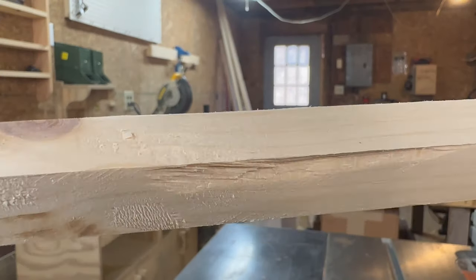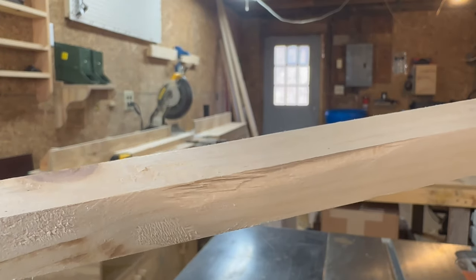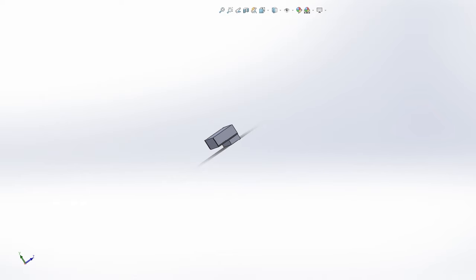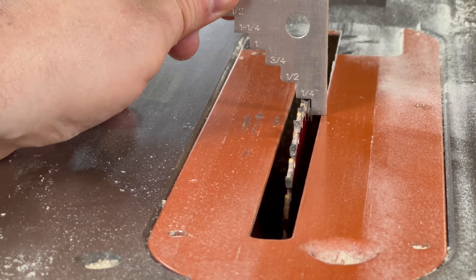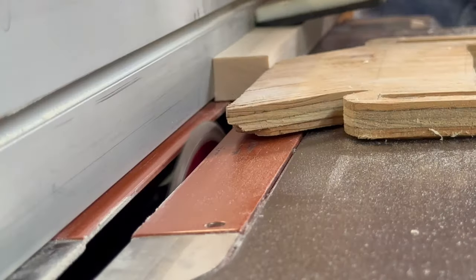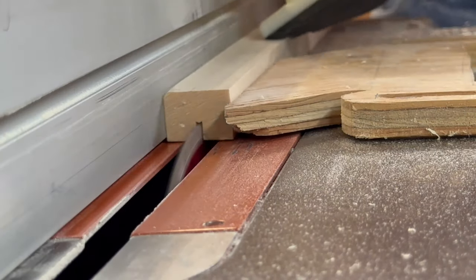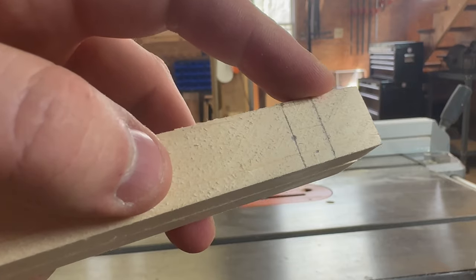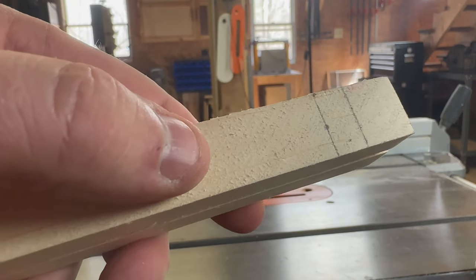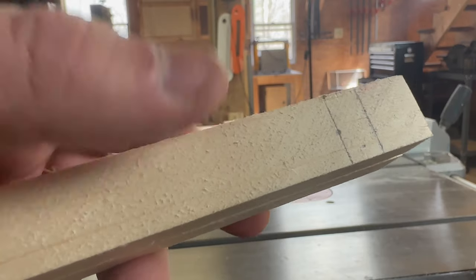Some of the knots in the material did play havoc on some of the edge quality, but some of the machining should take care of that. I don't think it'll be a big deal — I suppose we'll find out. First thing we're going to cut is a quarter inch deep groove down the center of this little board, and that's going to be in preparation for this little backrest. I've laid out the dimensions of the notch that we need to make, and this little dot here is how deep we have to go. We could do it with a stacked dado, but we're going to do it in multiple passes. It shouldn't take too long because we're not going very deep and we're not going very far.